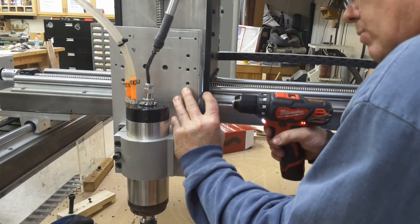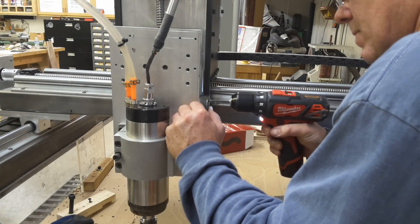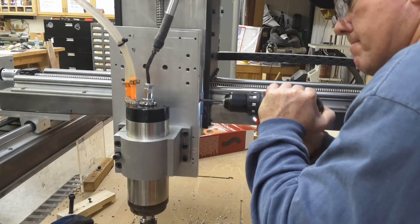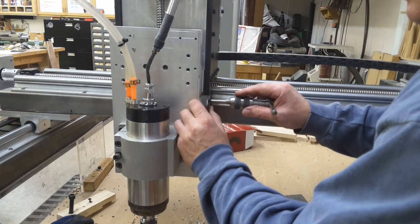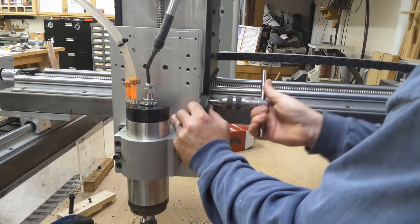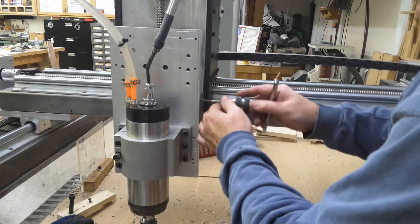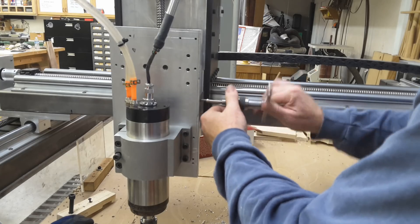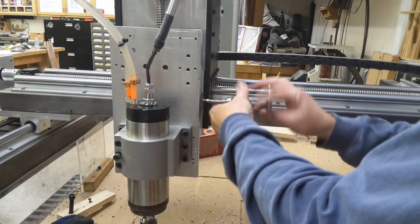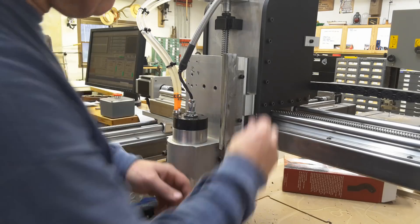I laid out for the holes that I needed to drill and tap on the side of the Z-axis — that's a piece of half-inch aluminum I'm drilling into. The little block I'm holding is a guide block that my father made ages ago to help guide hand tapping. I start with a regular plug tap and then finish it off with a bottoming tap, just to get the most out of it. I didn't want to drill any further than I had to, so this got me a couple of extra threads. With the holes drilled and tapped, a couple of quarter-20 socket head cap screws finished it off.